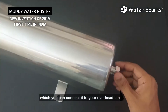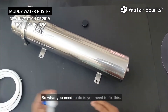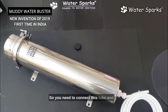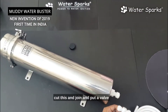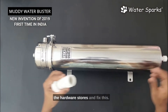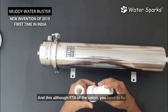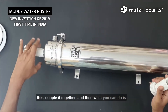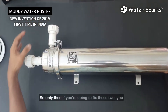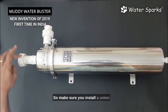You can connect the purified outlet to your overhead tank. There is also another outlet line at the bottom which is the drain line. You have a three-meter tube included — connect this tube, cut it, join it, and put a valve here. You need to buy this from hardware stores. This is an FTA with a union; fix those FTA unions on both sides, then couple them together. Only then can you uncouple and remove the whole unit. Installing a union on both sides is mandatory.